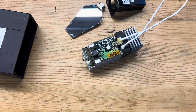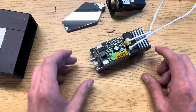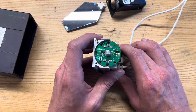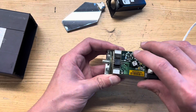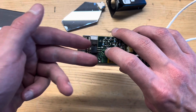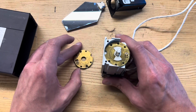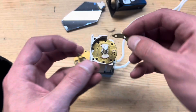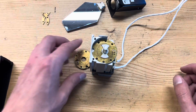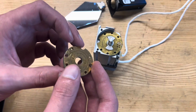There's two cables going in, and if we look at the ends of the cables it's clear that some amount of data and some amount of power are feeding the thing — data coming from this feedback, and then this heat sink is certainly suspect of some sort of actuator. The feedback mechanism on this is really neat. Starting from this end, I've taken the screws out already. We have a stacked PCB design where the front PCB actually plugs into a connector through this second one. Pulling that off, we're immediately met with some really pretty gold-plated PCBs.